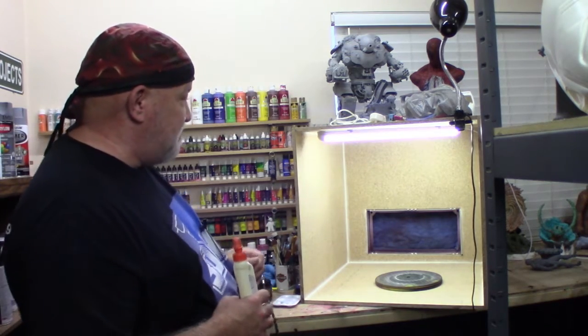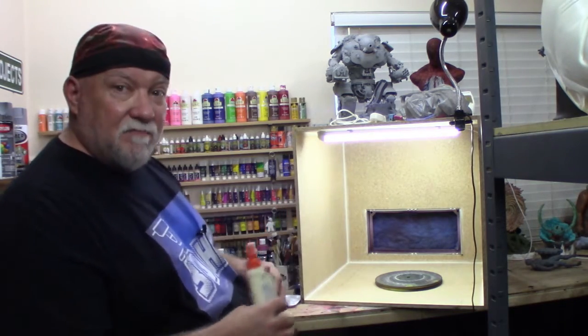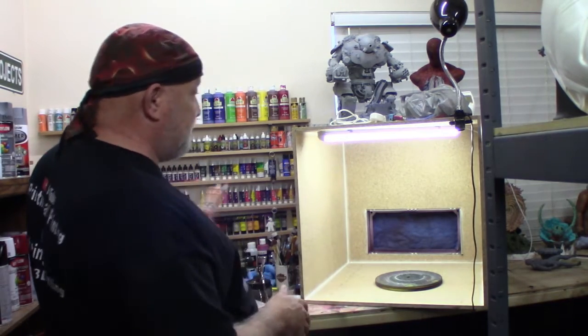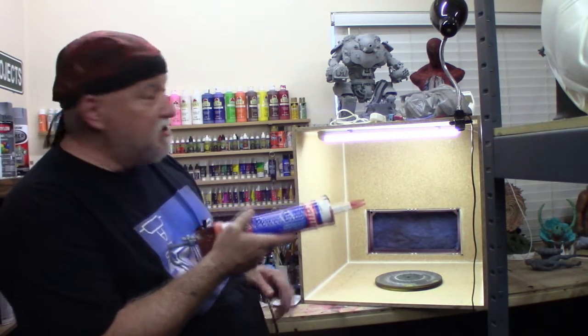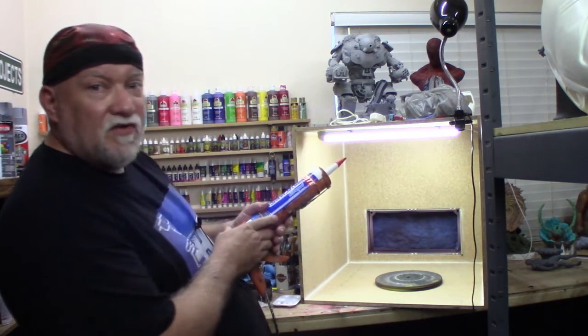The next day, I took my box, laid it on the particle board, cut it out, made a template, used my skill saw and a hand saw and cut it out very carefully. I glued that together and put screws in it. Then I got some Loctite Power Grab and caulked all the seams really well on the inside, and let that sit overnight to dry.